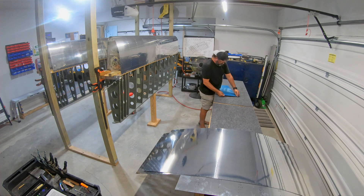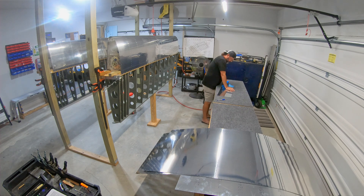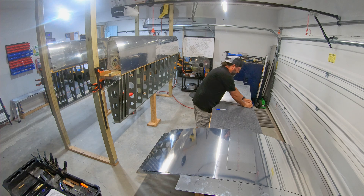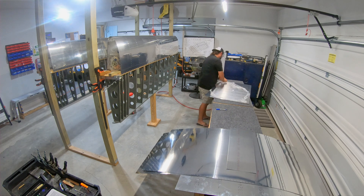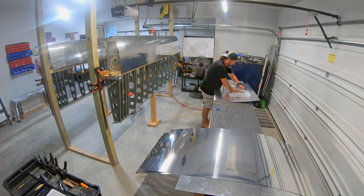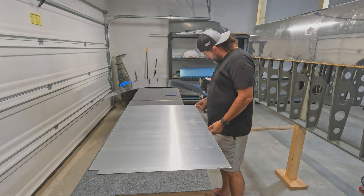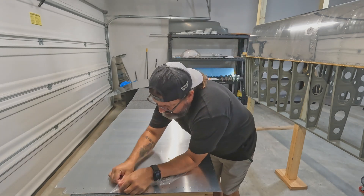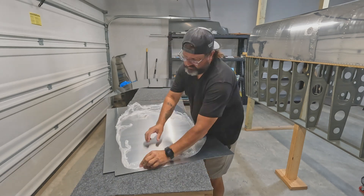You don't want this obvious stack of two pieces of 25-thousandths thickness immediately adjacent to the fuel tank skin where they all come together. The fuel tank skin is 32 thousandths, so I'm not saying one should try to get both overlapping parts at the corner down to 16 thousandths a piece — that's pretty thin — but just get it close. So when it comes time to paint, that transition between the tank and the overlapping main skins will look a little less wonky.